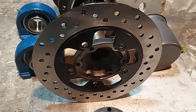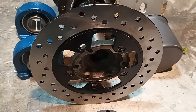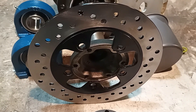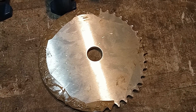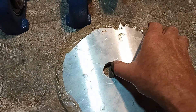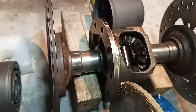I intend to have inboard disc brakes — these are the disc brakes from the Suzuki 900 — which means I'm going to have to put in some sort of adapter anyway to carry the brakes, and now this adapter can also carry the offset in the bolt hole locations. The diff also needs to be converted to sprocket drive. This is a 41-tooth alloy sprocket suitable for 530 chain, which is what the Suzuki 900 has. The center will be removed so that it can move over the top of the diff housing and spider housing, and be bolted into the areas where previously the ring gear was bolted.